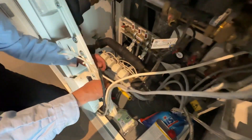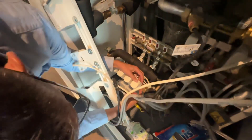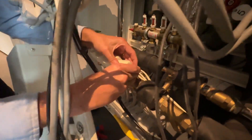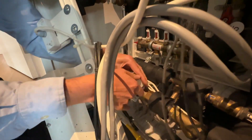Before I do that, I'm going to remove these valves — it's important because that one's been under some load and blown up. These are easy to remove — these are the valves that the thermostats control. You unscrew to get them going: you turn the silver screw and the actuator together anti-clockwise. If you just turn the top it does nothing — you've got to hold the little screw underneath just to get it moving. It's quite tough — there we go. Once it's moving you can then turn the screw yourself.